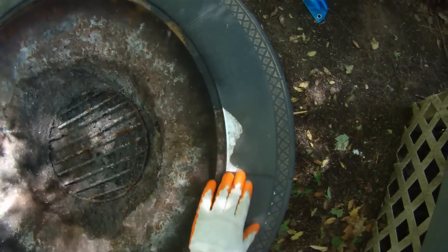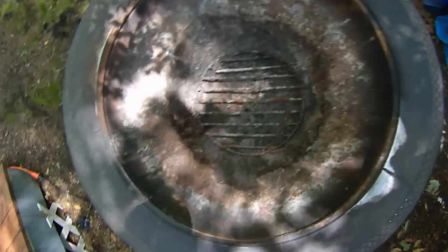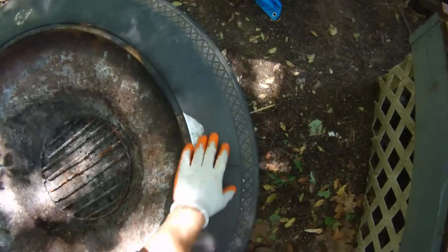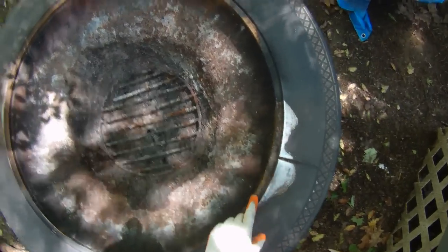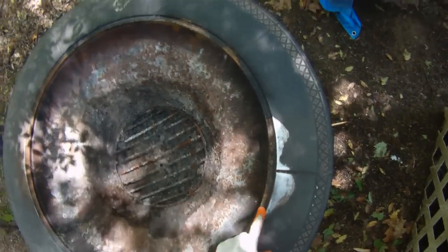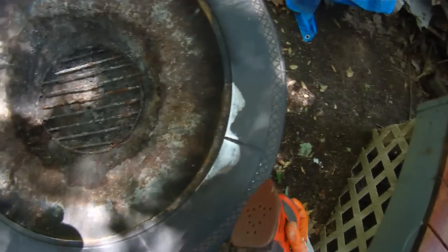There you see I've gotten down to bare metal. We don't have to get all the paint off — you just want to get anything that's going to chip off. I'm going to give it a quick go around on top of this just to get any loose chips off. But all in all it's fine to spray on top of this paint here. You just want to get any of the rust off. If you spray on top of the rust, the paint will just fall off. So that's why you want to get that rust right off of here.